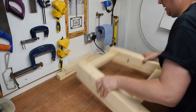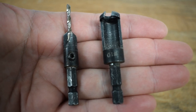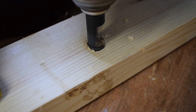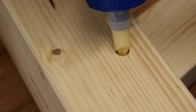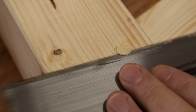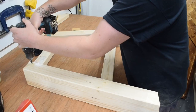Perfect, easy mortises. So about these plug cutting sets — we use these to drill a pilot hole for our screws, and then what we can do is cut a wooden plug with a grain that matches approximately what we've drilled into. Apply plenty of glue, stick the plug in the hole, give it a tap, cut it off, quick sand — Bob's your uncle. Beautiful.